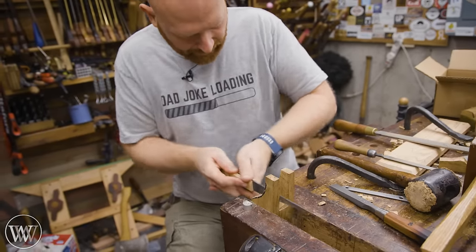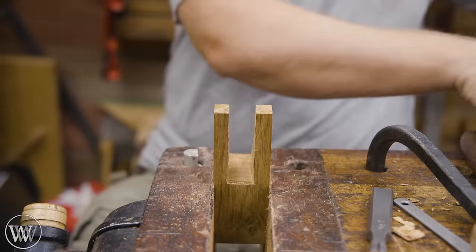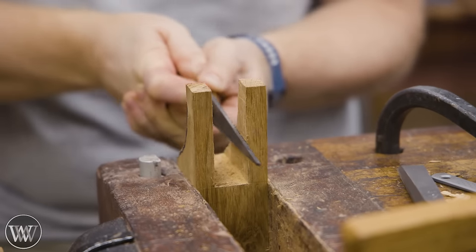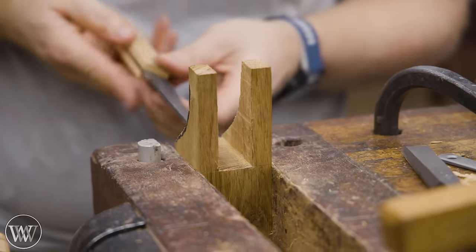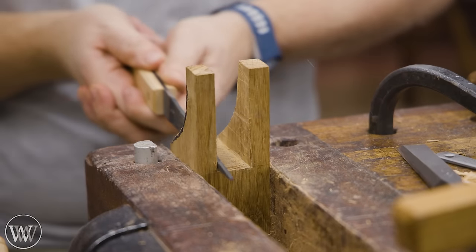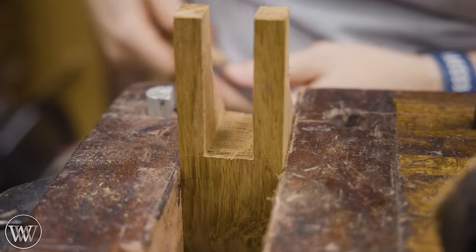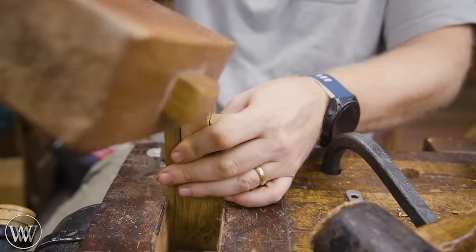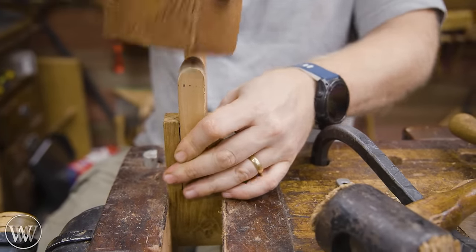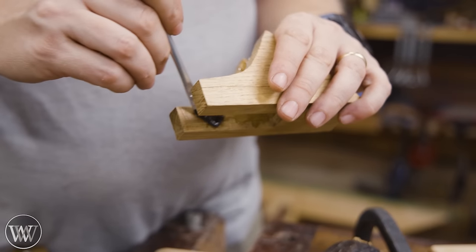I'm going to come in with some plane floats and files and detail it down. The handle doesn't quite fit, so it shows me where I need to remove some material. This is why these are called plane makers files — plane makers use these a lot and they are absolutely amazing. If you're going to be doing anything with plane making or general woodworking, getting a good set of plane makers files is phenomenal. These ones actually came from Red Rose Reproductions, purchased this summer. Now we can fit that handle in, make sure everything is the way it needs to be, and then glue it.